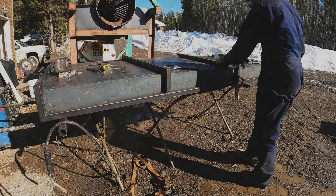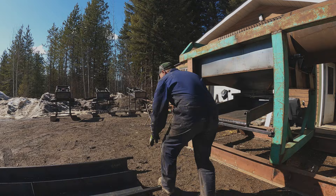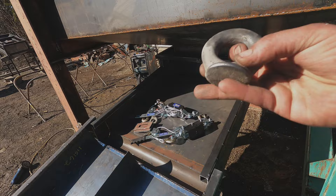This sluice box is just tacked together — let's wiggle it over and mock it up to the trommel. Before we go welding these two sluice boxes together I just need to weld these perches up top for the come-alongs.